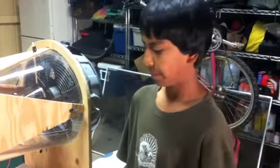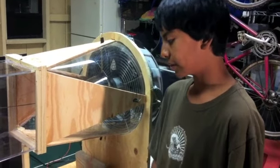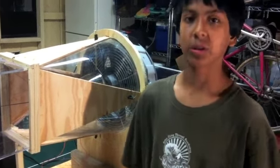The wing is pushed up and pulled back, and then this rod leads over to the center part of the scale that has a guide, and it pushes against the scale and gives you the reading. These are very sensitive scales — they're jewelry scales that my dad and I got off eBay — and that's how my lift and drag mechanism works.